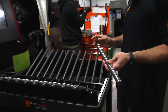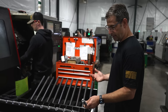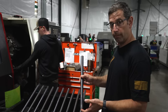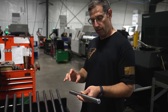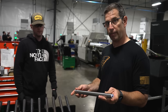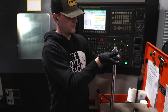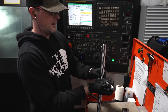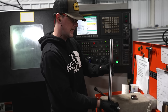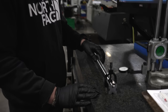All of our barrels are turned concentric from the bore to the OD within a thousandth over the length of 16 inches — 17 inches in this case. Here's the barrel with the mill scale, and here's the barrel after turning concentric. Cody is going to check the barrel OD and also use the ring gauge to make sure the barrel is straight. Then Cody checks the barrel for concentricity — we're looking for less than a thousandth of an inch.